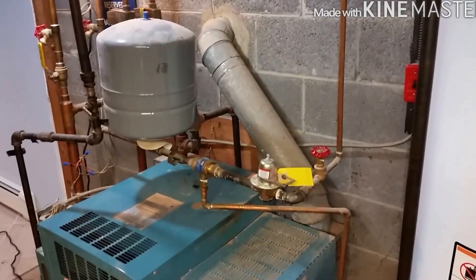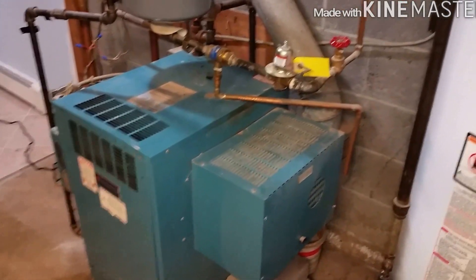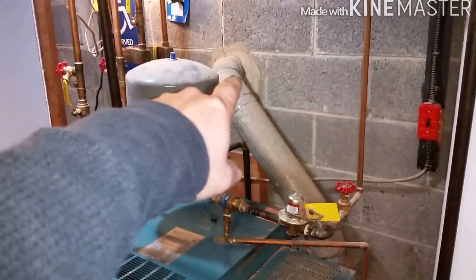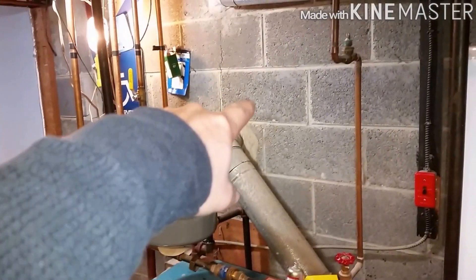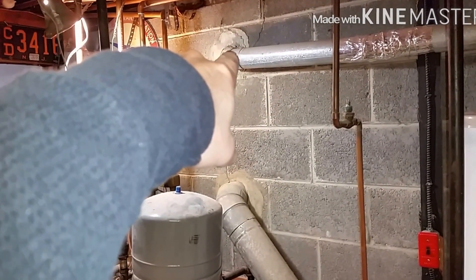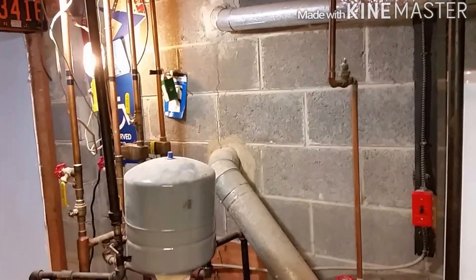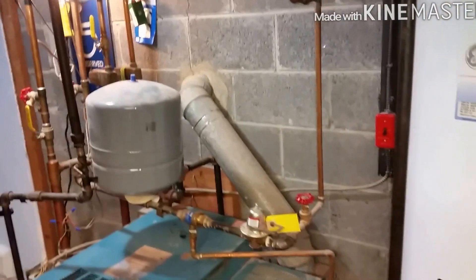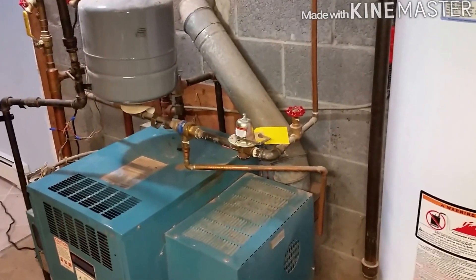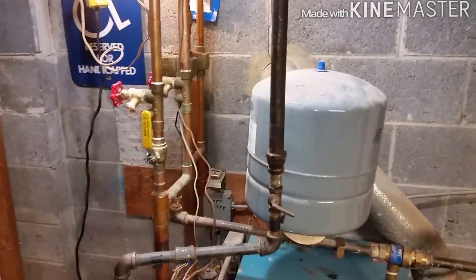He has a regular conventional masonry chimney, so we don't need a draft inducer motor. We'll probably have to bust up higher and make a new hole, or enlarge it and put a 5- or 6-inch flue connection — we'll figure it out. Not a big deal, redo it all — should be fun.